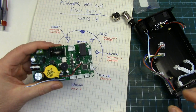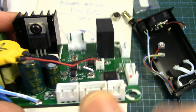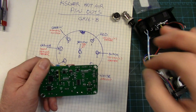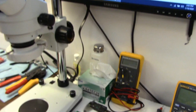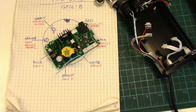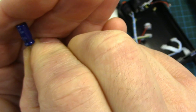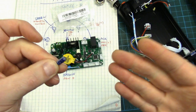The other thing I'm going to do is put a small capacitor on the fan circuit — I don't know if I'm going to do it inside the gun or right at the gun input/output plug. When the fan is running at low speeds, it's very pulsing — you can tell it's being switched on and off fast by the little MOSFET that's controlling it. By putting a cap in there it just smooths it out. The schematic shows a 47 microfarad across the motor with an electrolytic cap. I've played with this and found 47 was too much — it was storing too much voltage and the fan was running too high. You couldn't turn the speed down as much. I'm going to be putting in a 10 microfarad electrolytic cap rated at 50 volts. The fan is getting 25 volts, so as long as it's a 25 volt or higher capacitor you'd be fine.